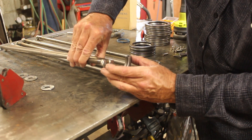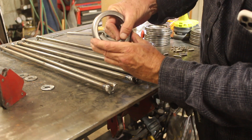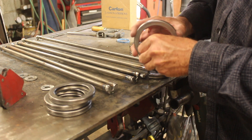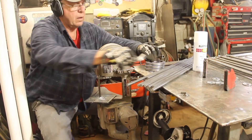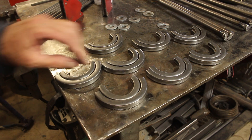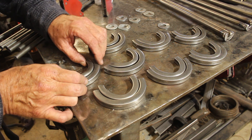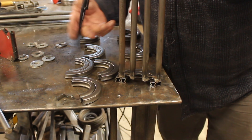Each of these does this, and I think we'll mount it like that. This will give us our next level in the fractal movement. I'm going to need eight half rings for these to slide in, so we'll just cut these four in half to make eight. Now all those fit perfectly but they're a little bit longer than they need to be, so we'll trim the excess. We've got a pretty good motion there. We want the spacing to be the same between each segment as it is between the bars.